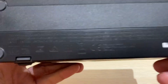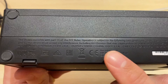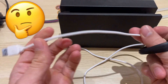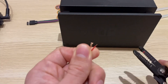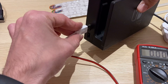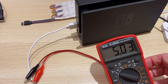Next is figuring out how to power these LEDs from the Nintendo Switch dock. The bottom of the Switch dock says it's a 15 volt output, but on the side there are USB ports, which doesn't quite make sense. To test that, we'll take a cheap USB cable, cut it open, strip the power and ground wire, hook it up to a voltmeter, plug it into the Switch and see what it says. Looking at the multimeter, it is a 5 volt output, just like a standard USB port.